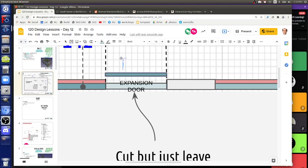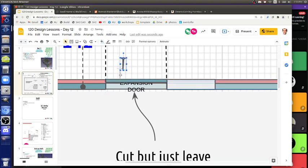Because the foundation is concrete, in order to be able to penetrate the concrete, that's why you need Ramset nails. You can also, they do make nails that you actually ram with a hammer too. They're hard to get in. The Ramset is very convenient. You tap it once and the bullet does the work for you. But that's what it looks like. There's a few, like every foot or every six. The schedule for that would be to put in two at the ends, like 6 inches, like that.